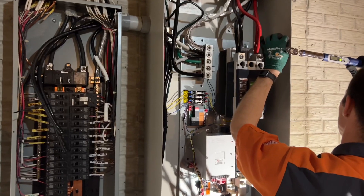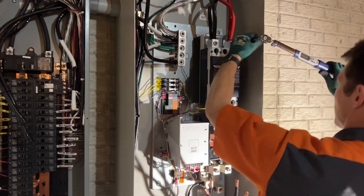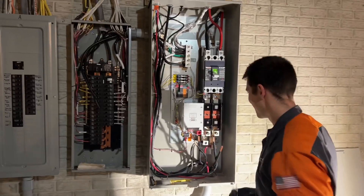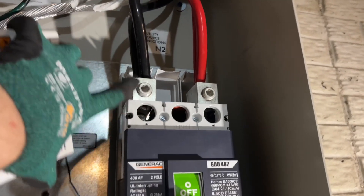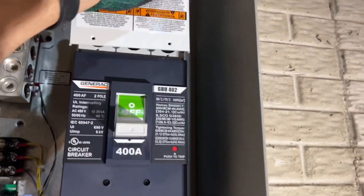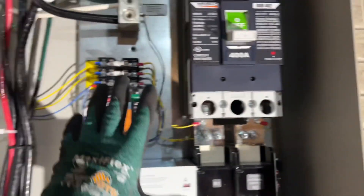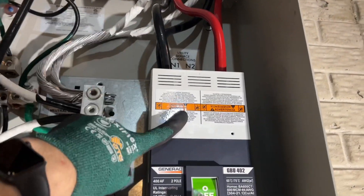There won't be any fires in this house. Great grip, looks good. A code violation that's very common in both transfer switches as well as panels is that if we've got these plastic covers, they do have to be installed so that there are no exposed energized parts in these panels at all. Very important — a lot of people miss that one.